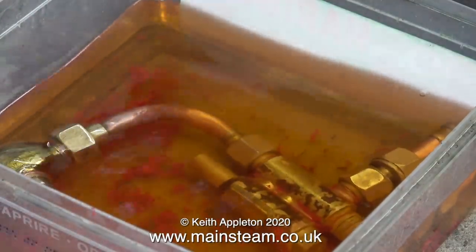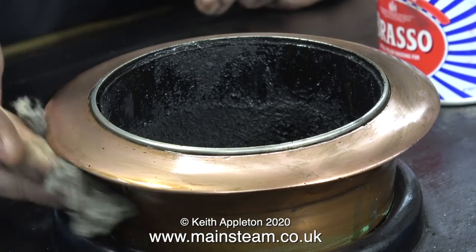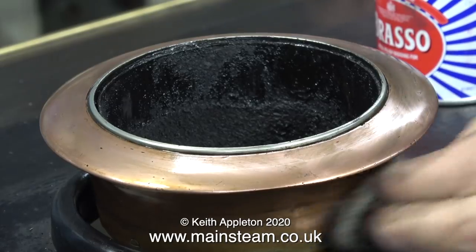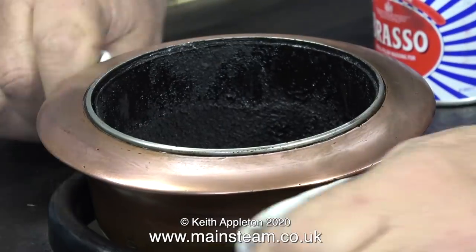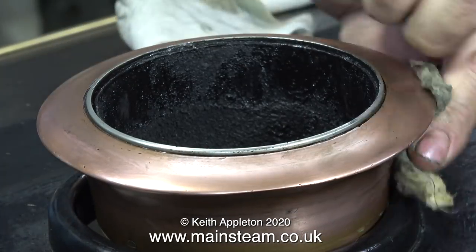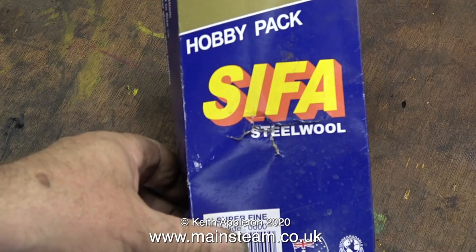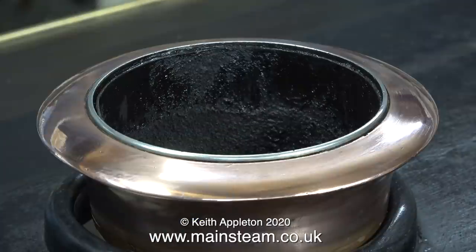While the injector soaks, I'm going to clean up the nicely made copper top of the chimney. The chimney does unbolt from the saddle on the smoke box, so I could have removed it completely and used my polishing spindle to polish every inch of it — but quite frankly I think this is a waste of time, because as soon as the engine is put back into steam the copper top will go dull again. That's why I'm using Brasso wadding and a cloth. Another alternative is very fine steel wool — a viewer from Australia sent me this to try and I use it quite frequently. It's a little bit more abrasive than Brasso wadding, and here is the end result: wire wool followed by Brasso wadding, and I think this is more than good enough.